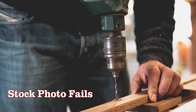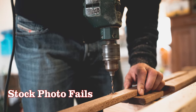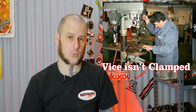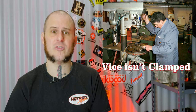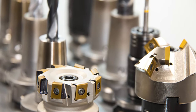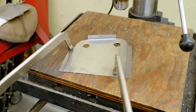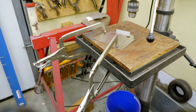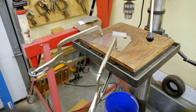The last drill press tip: clamp your material down. This is such a basic concept but I see so many people ignore it. Trying to hold a piece by hand while drilling is a quick way to hurt yourself, hurt the equipment, and break drill bits. The few seconds you save are not worth the danger. When the piece grabs and spins, that's when you bend or shear a drill bit or break a hole saw. Personally I just use vise grips — at least two clamps on every piece I drill, whether sheet metal or plate.